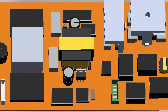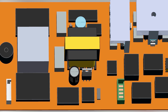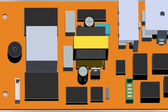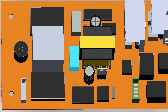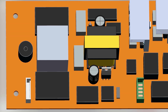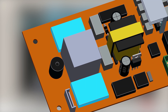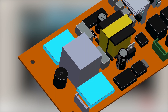Moving on, we have a familiar looking circuit — this is the charger circuit, used to charge the battery and to keep 13.6 to 13.8 volts continuously at its terminals. This is a full bridge rectifier IC. Here we have a battery monitoring IC and a charger control IC. This is the snubber capacitor for the transformer, and the diode and resistor are below the PCB as SMD components. These blocks contain the main controls of the board, used to monitor and control all parts of the circuit — they are digital ICs, not analog circuits, so we will explore them in another video.